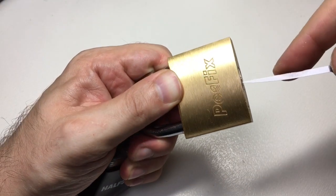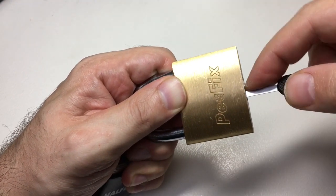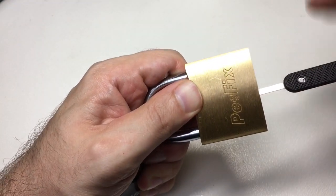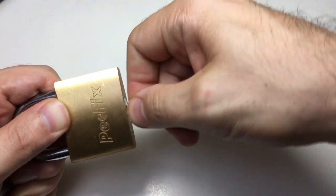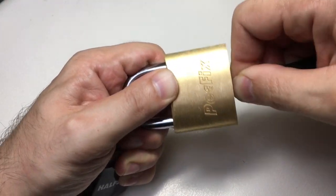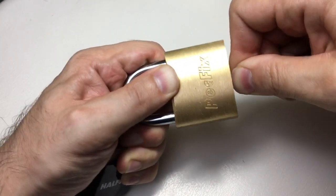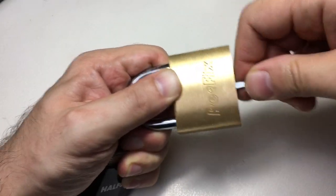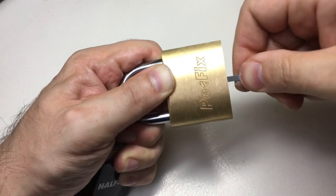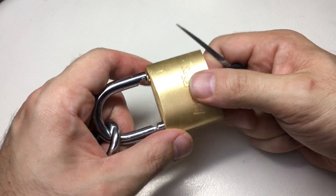It's a bit harder than, like I said, a simple perspex lock. So, heavy tension on. Go in, and you'll see that it isn't quite in. It needs to sort of wiggle into place there. It goes down a bit further. And then tension on. And what I do is I don't hold the knife here. You're going to snap it. Hold it right here and manipulate it with your fingertips if possible. And then you're just going to try and work the actuator mechanism back and forth to the back of the lock. And if you need to take it out, then go back in and then turn it around a bit. There we go, and we've got an open. But it does take a little bit of finesse.